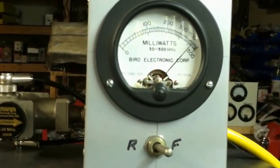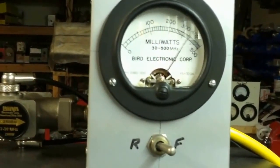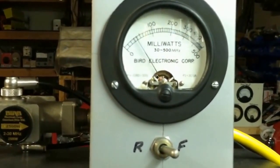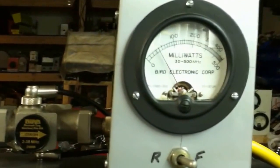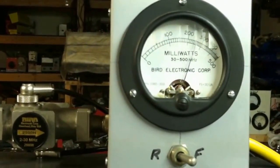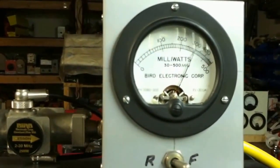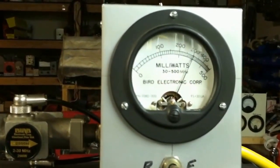As you can see, it'll do 2500 out no problem with about 50 watts of drive. Turned out very well — it's a great tube. There's 1500 out with only about 35-40 watts of drive.